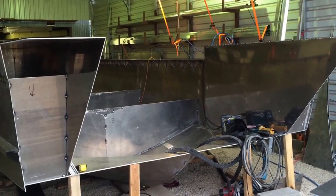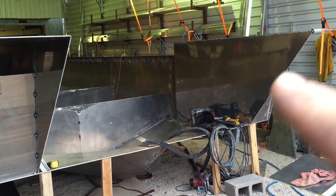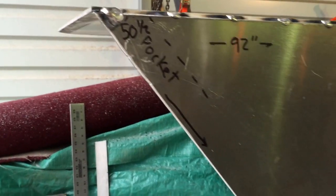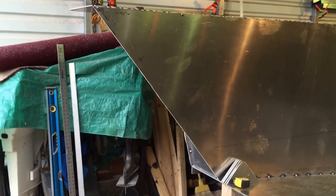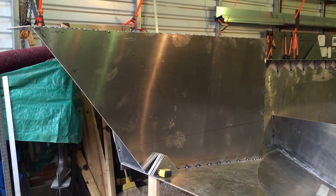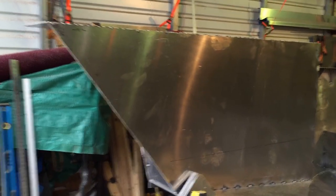I cut off the tugboat push-front stuff. I left these at 40-degree angles, and there'll be a pocket welded there that the landing craft door slips up into — completely waterproof, so waves hitting the front end can't come into the boat. That box right there is going to hold the anchor chain, anchor line, and hopefully an electric windlass to retrieve the anchor.